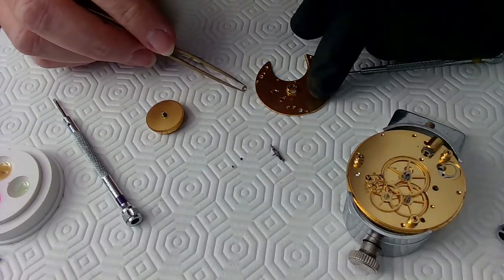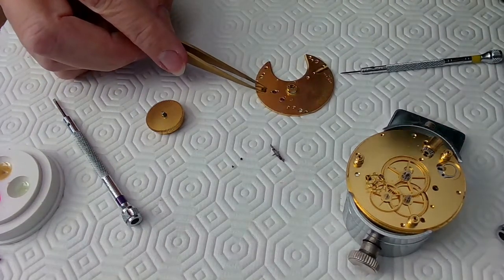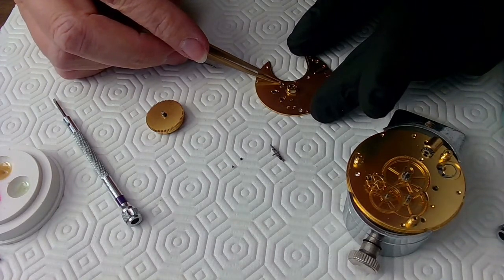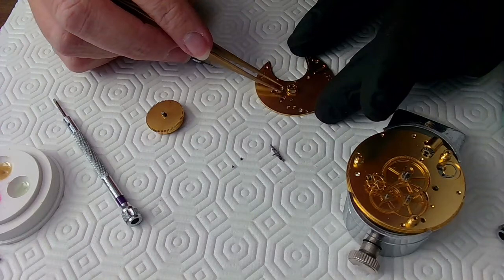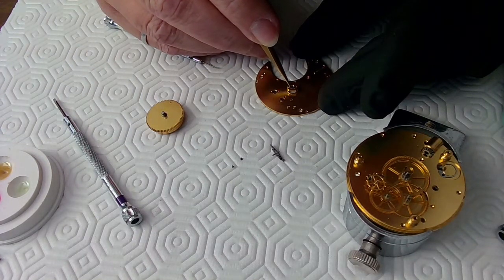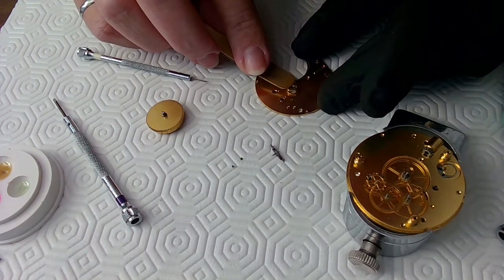And let me have a look at the cap as well and make sure there's no smudges. It's in pretty good condition. And I'm going to take out any dust or anything that's on there too. And then I'm going to look at the witness marks to make sure that witness mark I put down there is lined up. So I can see the witness mark, and I can see the scratch on this side. And so it would go on like so. And then I want to line up the screw holes. Don't be jumping out on me. I use the back of my tweezers to push that down.